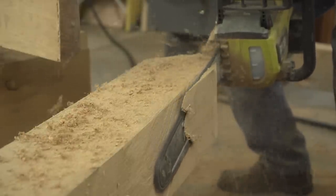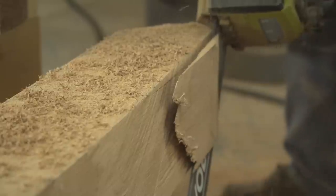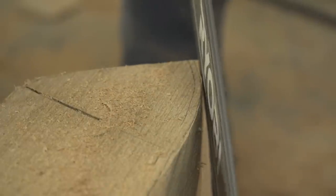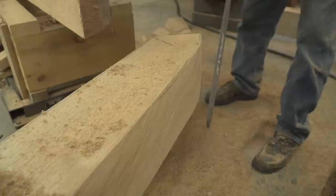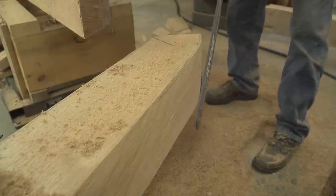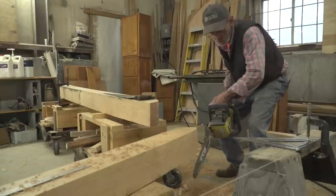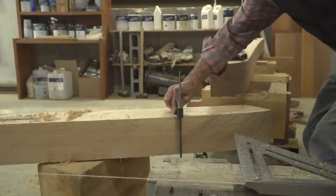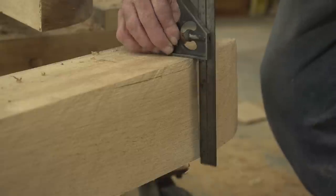I'd have to smooth it up anyhow even if I cut it with a bandsaw. We're trying to get the right shape and approach angle to the corner where it connects to the stem. It's a little aggressive cross-cutting and doesn't cut a very wide slot. I can scrub it with the side of the chainsaw to get it nice and square as long as the chain is fairly tight. I take the tip of the chainsaw and scrub that out — it's the fastest and easiest way to get that into control.